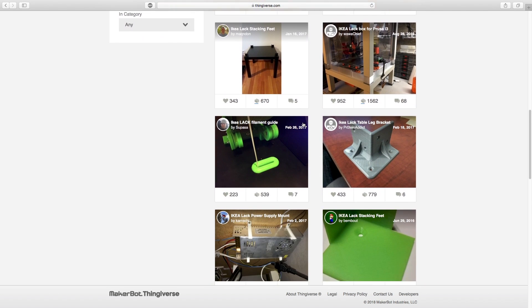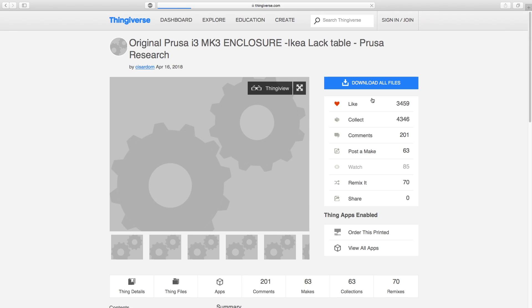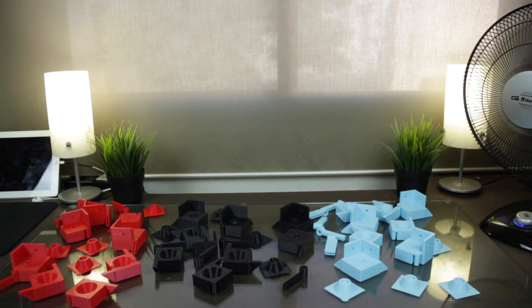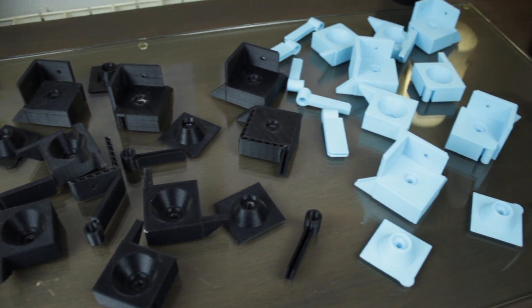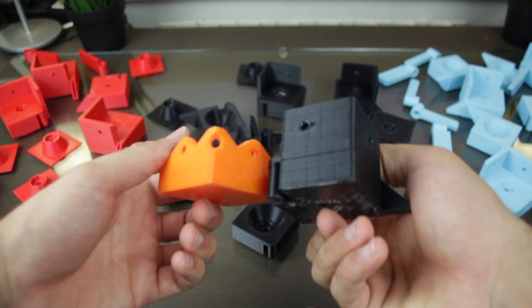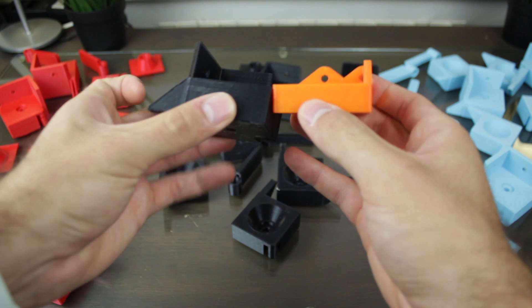There are a lot of designs on Thingiverse to build the IKEA Lack shelving solution. I first went with the solution created by Joseph Prusa and published on the Prusa 3D blog, which includes a solution to build your enclosure looking great apparently. Then I printed all the necessary pieces in PLA three times, and when I assembled the first pair of tables it resulted in a very weak and unstable solution. The joints were also very big, so I decided to design my own. As you can see in comparison, these ones are very stiff and robust while being very small and great looking.